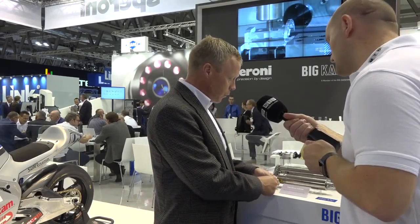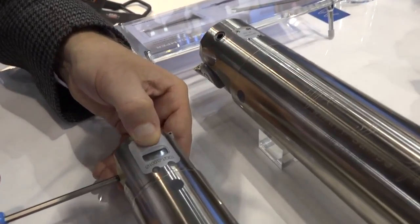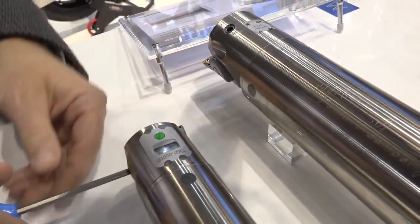If I put the tool into the wrench and start to turn, you'll see that the digital numbers will increase or decrease. This is actually reading directly onto the tool carrier, so it's giving the operator exactly the size that the tool is moving without any influence from any other source.